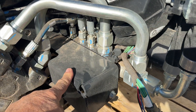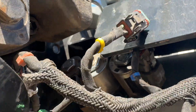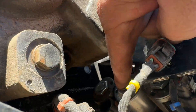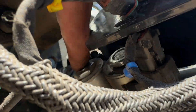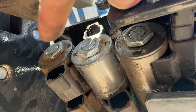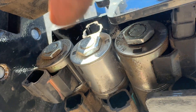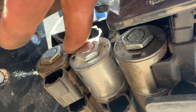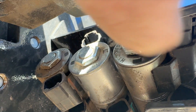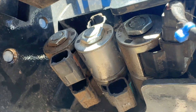The solenoids are inside here — we've done this underneath here — and then there are nuts up in here. I've come in and loosened the nuts so I can bring all of the Deutsch connectors down, making them easier to access. Then I pull all the plugs out.